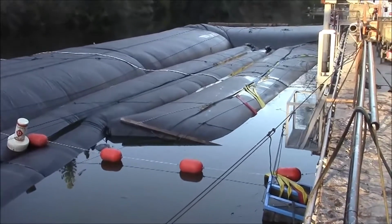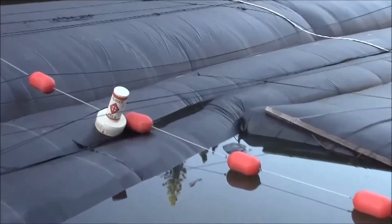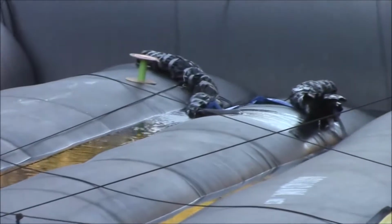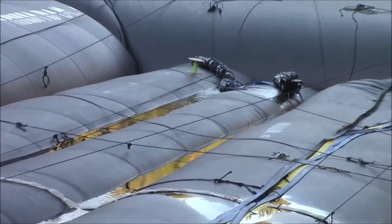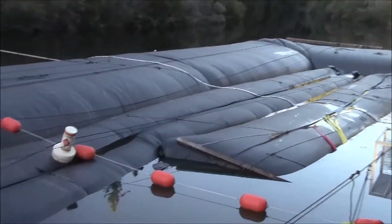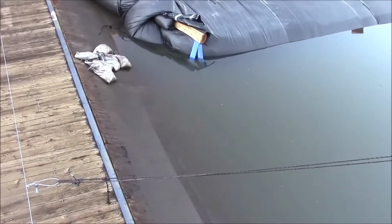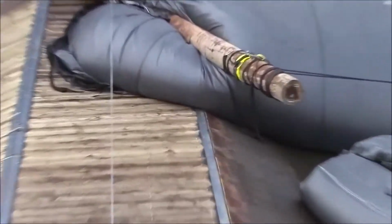The AquaDam on the right will be taken out by the contractor. The AquaDam on the left will drain down until it is at 8 feet in elevation. It was much taller than that when it was installed into deep water. They round out in deep water. So we drained it down as the water level in the work area dropped down. We've already lost 1.5 feet of water depth in here. The 4-footer has terminated approximately 1 foot from the edge of the weir.